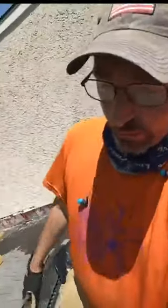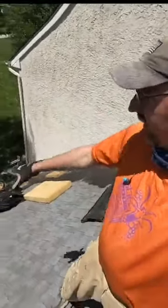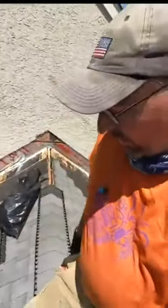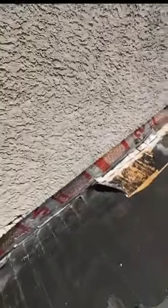So that's the fun scoop on this project. At this point, we're going to wind up replacing this entire roof because we just can't get the shingles apart in a way that's going to allow us to put it back together in a watertight manner. So this whole roof is going to come off and get redone. But right now, we're worried about getting that corner waterproofed the way it needs to be — a piece of lumber in there, new step flashing, some new Z flashing, some new ice and water shield, and it's going to be beautiful when we're done.